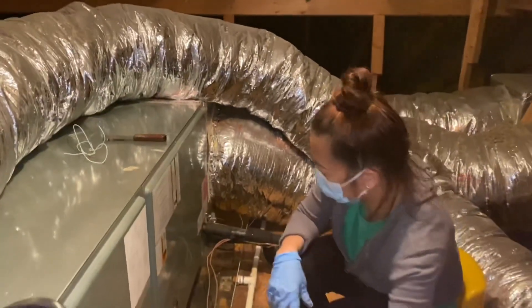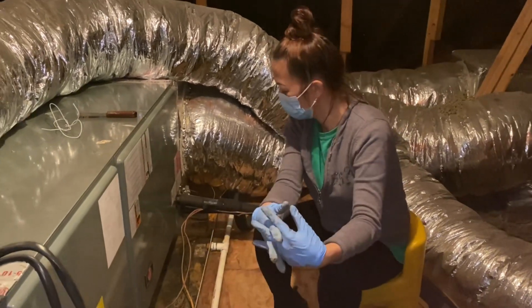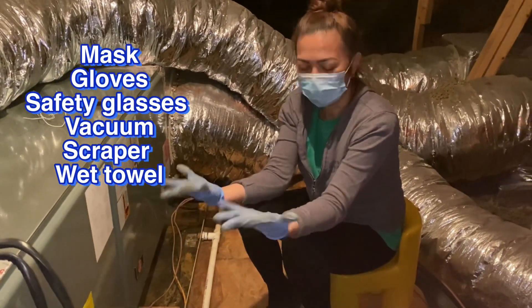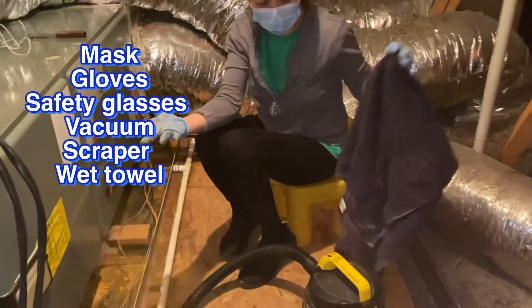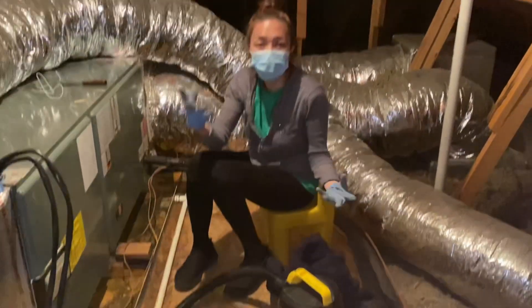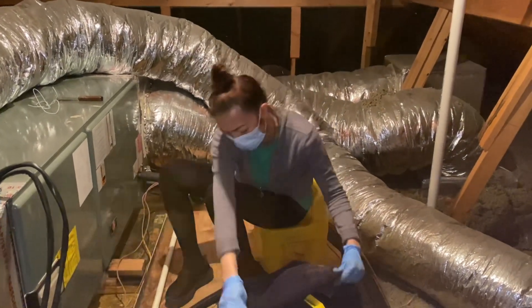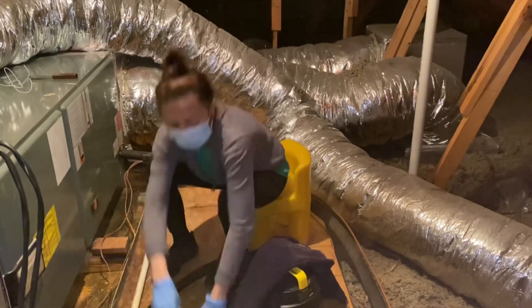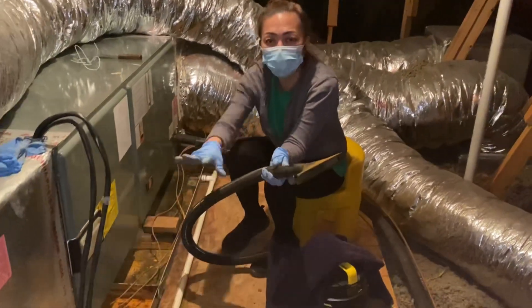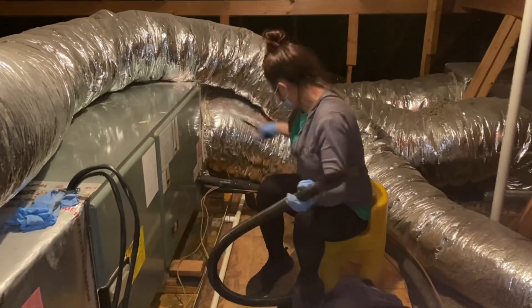I have a question: what kind of equipment do viewers need for this project? I saw you with gloves and a mask when you were working. In the attic, you should wear personal protective equipment — gloves, safety glasses, and a dust mask are necessary. A towel to prevent dust clouds from swirling around you will also help. The only tools I need are a putty knife to scrape the rust off, and a shop vacuum or a dust pan with a small brush.